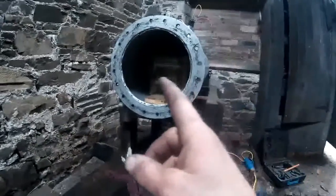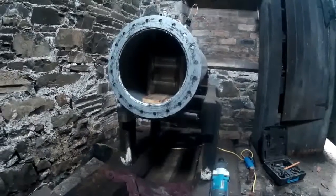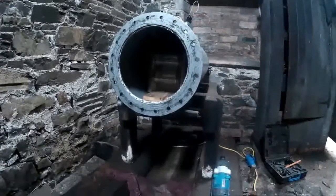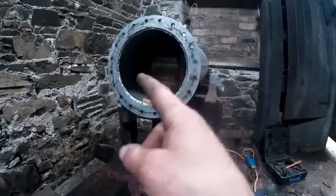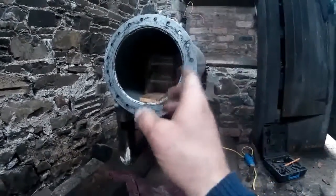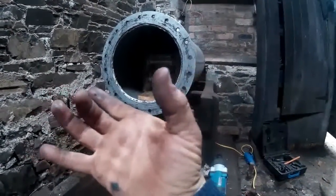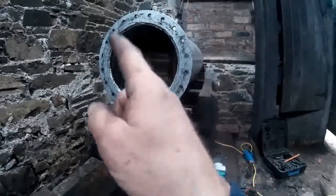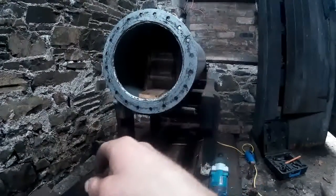And testing the one on the left, the top left end cap is a plastic, low density polyethylene. I think that one was. It didn't have quite the same compression on the O-ring as the other GRP ones, but just testing the idea of the bolt running through. So before I think they were failing because the bolt running through was meeting the bolt from the other side. As the end caps compressed, the seal on the back was released, and then there was no seal on the inside. So this has seal on the back and on the inside. And I thought might as well test it out.